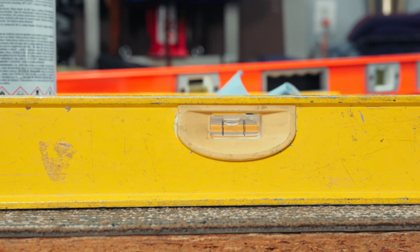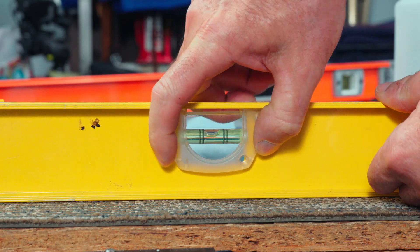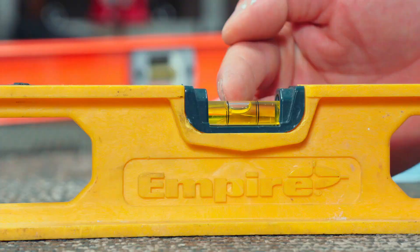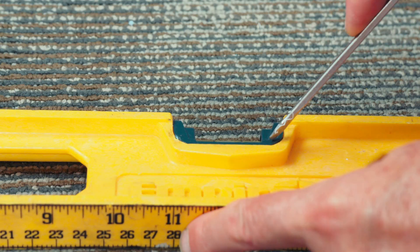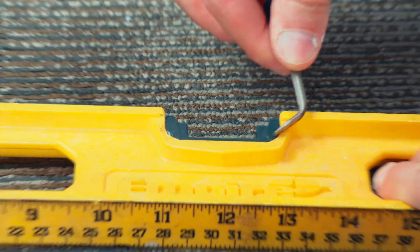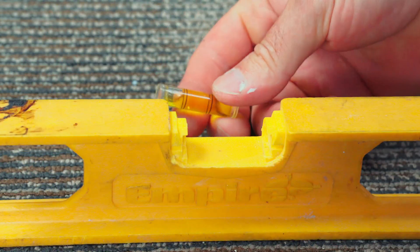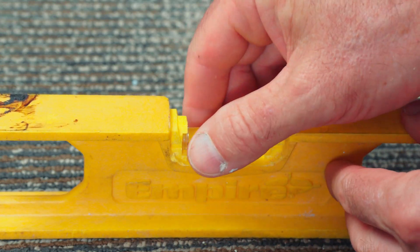I'll also show you how to fix the vertical vials here in just a minute. Here we have an example of one that does have the screws — the window does rock back and forth — but the vial itself is fixed right here in the frame, so this one is not adjustable. However, it's still fixable. The vial is fixed in the frame. We're a little bit past the line on this side — flip it around, and it's not quite accurate. Let's go ahead and get this cover off. We're fixed in the frame right here. All we have to do is push this out, and that will come out of there. One thing you can do is try to flip it, spin it around, and put it in a different position to see if that'll fix your problem.